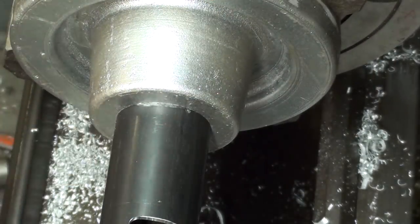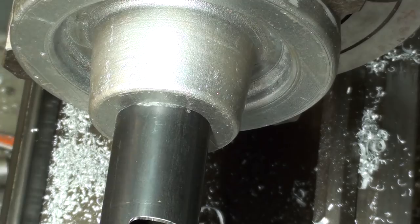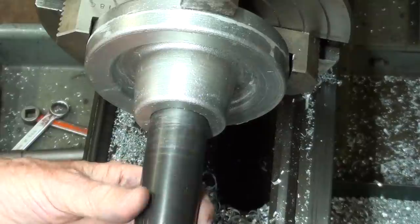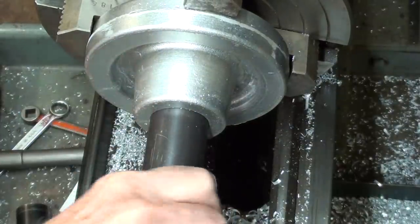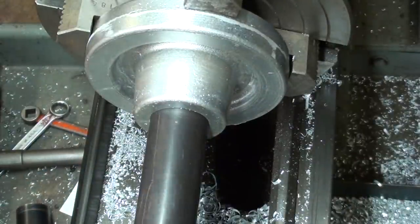It's just barely started, so I'll take one thousandth more and go all the way through. I took a couple more thousandths off and I'm getting a really nice fit — very happy with that. Just a little bit of room in there, probably for the Loctite itself.